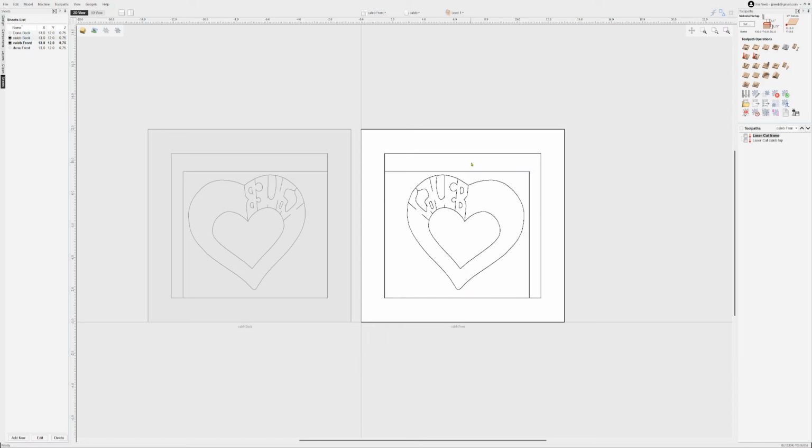After the project, these two items are what I call an alignment frame. This is something I'm going to put in this design, and I'm also going to cut this out. You can use a piece of MDF or plywood. In my case, I just like to use cardboard. That's cheap and it cuts really easily, because we're just going to put that on the CNC and tape it down or clamp it down or whatever. That's our fixed reference, and essentially we've got a reference on the left side of the project in this frame, and a reference on the right.